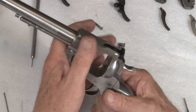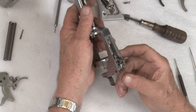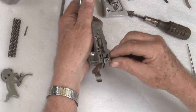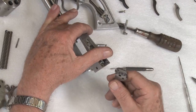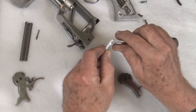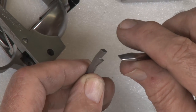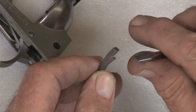Remove the cylinder. Now we go back and disassemble it again. You can disassemble the trigger and trigger pivot pin and the hammer and hammer pivot pin and get the hammer out with the trigger assembly, but sometimes you can take the hammer out without removing the trigger. We'll try that — push the hammer pivot pin out, hold it forward, lift the hammer up, and it comes right out. See this second step right here — it's trying to turn the cylinder further than what it can turn because the cylinder latch is already locked in. The only way you can do this is trial and error. Since it didn't cock on all six cylinders, we know we can probably take off maybe five thousandths roughly.